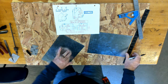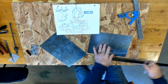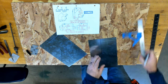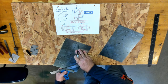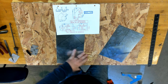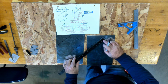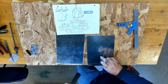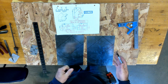So now I've got to measure four for the top, and I'm just going to draw that 45-degree line back. Now, if we did it right, from line to line intersections, I should end up with the same dimension. I have 5 and 11/16ths. I have 5 and 11/16ths, so my pieces are even. If they weren't even at that point, I would double check all my dimensions and find out where my mistake might be.